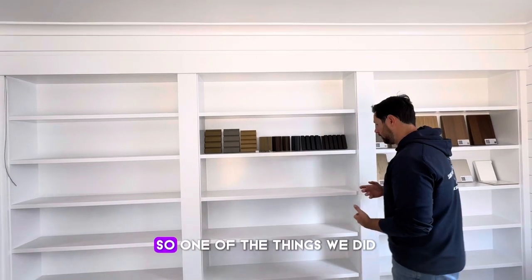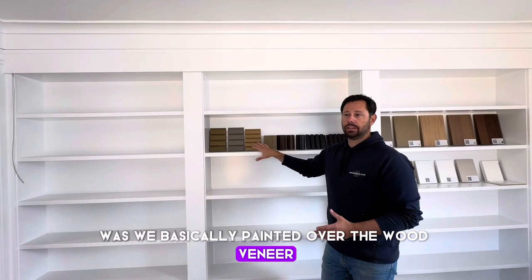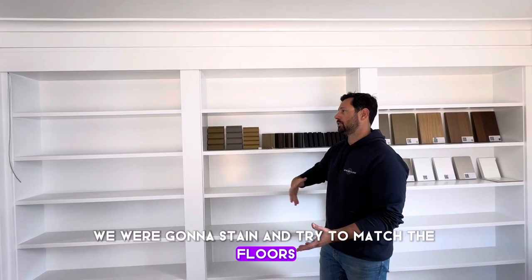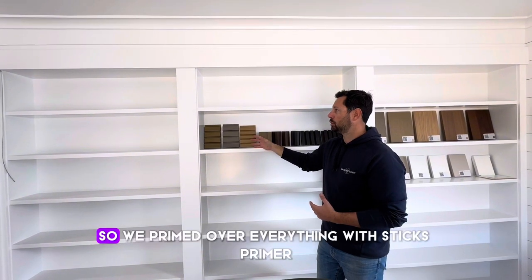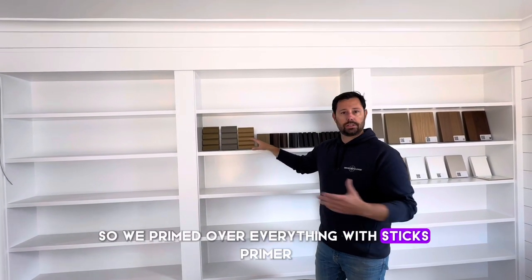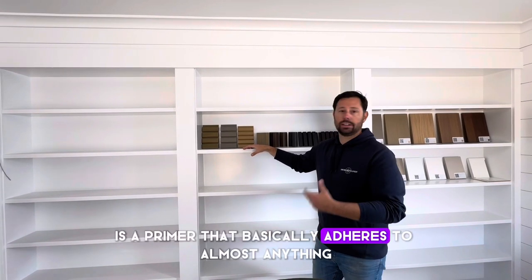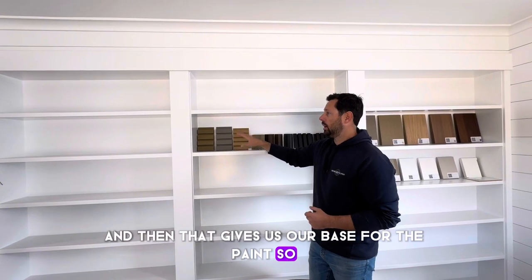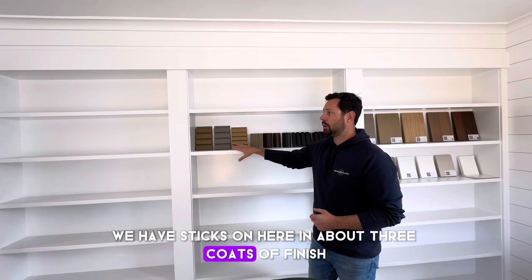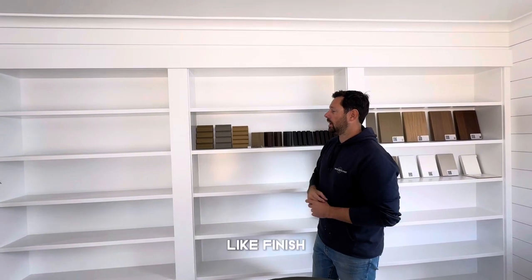This came out really nice. One of the things we did was we basically painted over the wood veneer. We were going to stain it to try to match the floors, but it didn't work out because the veneer was really cheap. So we primed over everything with Stix Primer, which is a primer that adheres to almost anything. That became our base for the paint. We have Stix on here and about three coats of finish. We sprayed this one because we wanted to give it more of that furniture-like finish.